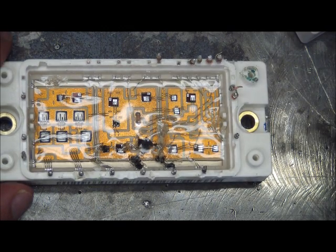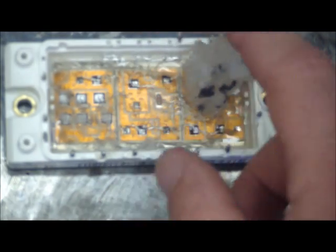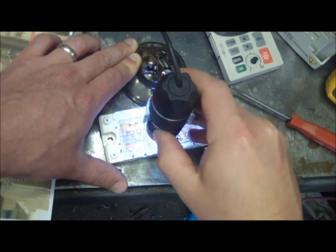I'd say any of the smaller diodes failed, and you can see the effects of the magic smoke monster captured in the goo. I tried to get the goo out to see what we could see. I pulled out the cheap $30 USB microscope for a closer look. Here's one of the fried diode patches — you can see it got quite hot; the lead end melted right off. So there's one fried diode, and there's another fried diode.